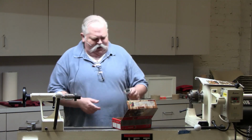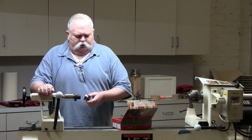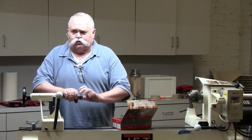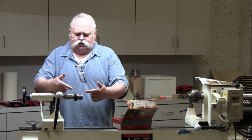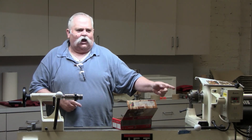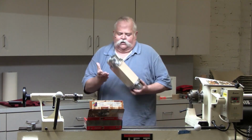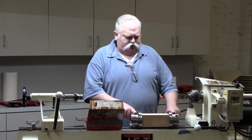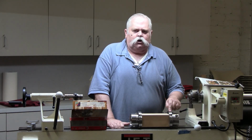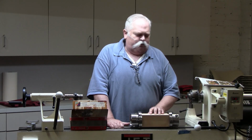Okay. Then you have to take the regular adapter that I use on the spindle output, and you screw that on. And this is one of those you want to make sure you have a set screw, because this one is turning the opposite way the headstock turns, okay? And then you do this number. These are 2 Nova chucks that I just happen to have. You have to get the 100 millimeter jaw set, because the 50 millimeter won't work on this particular type.